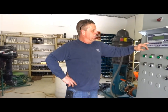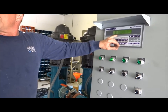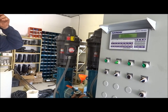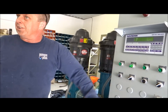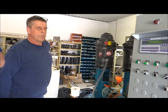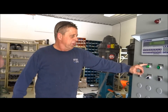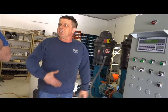Now it's doing its shutdown sequence - it doesn't see any flow, drops the RPMs, and then it shuts off. At that point, simply turn the rest of the pumps on and then you're ready for full irrigation. But you leave the other two off until you've filled the system, because with only one pump on, it recognizes it's in fill mode.